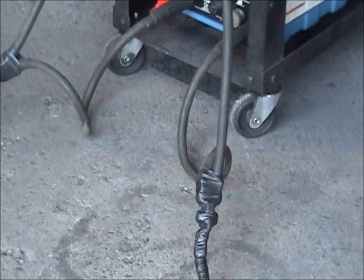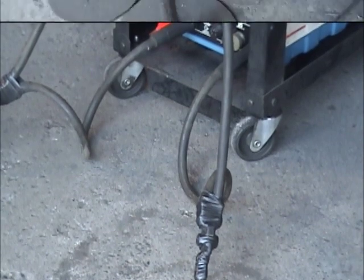We parallel the machines because we're going to be pulling almost 600, 700, 800 amps off these two machines. In order to get to those higher amperage levels, I've got to have both machines. There's a pamphlet from Miller that I learned how to do this from, and it basically shows this basic connection in that pamphlet.